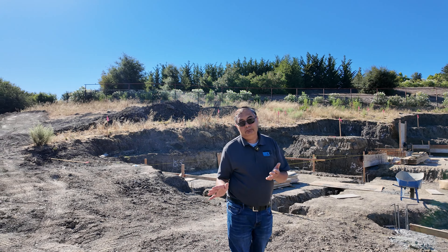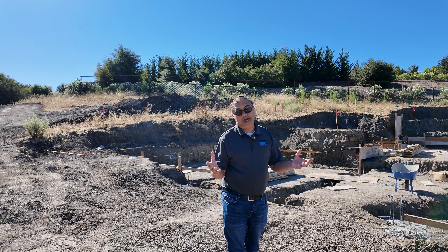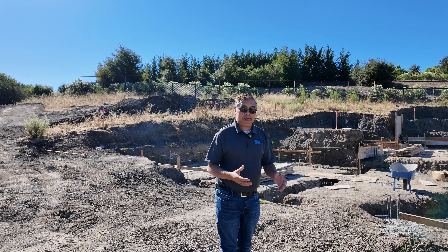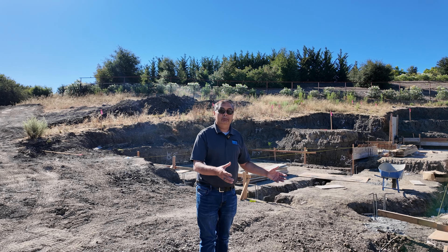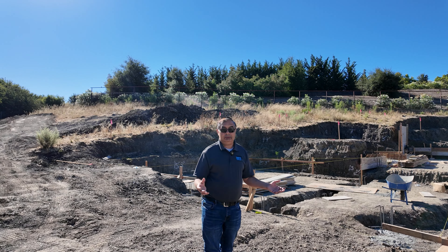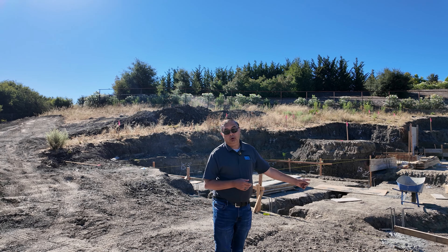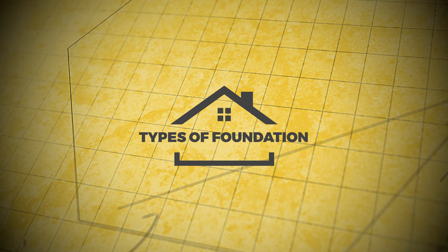The sticks also tell us all the corners of the property so we know how to position the foundation exactly as shown in the plans. Once we set up the foundation, the surveyor comes back and writes a letter stating we have placed the foundation exactly as shown in the survey and site plan. That letter goes to the city so they know we're situating things correctly and not making things bigger than shown in the plans — because their tax revenue is based on square footage.